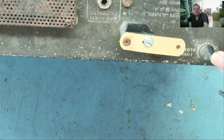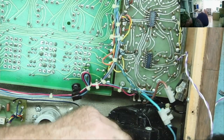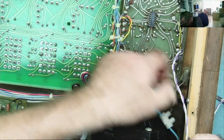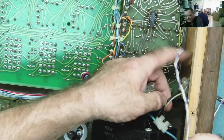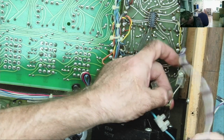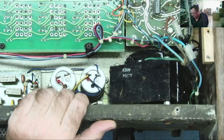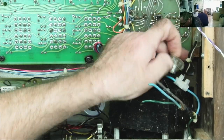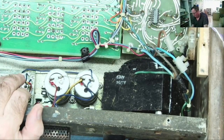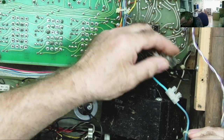So there's a fuse holder here. So I think we can say with good certainty the wire coming in goes to the fuse holder, and that's connecting back to this somewhere. But I don't know what this thin bit of white wire is doing. Not sure about that at all. Okay. Fuse is 1.5 amp. Again, if I take the fuse out, I can figure out if that connects there on that white wire or something. I mean, that's how it looks to me.